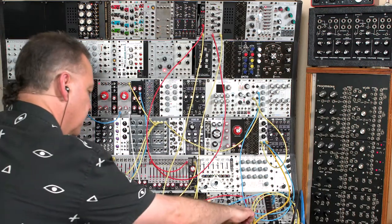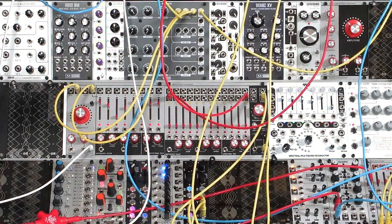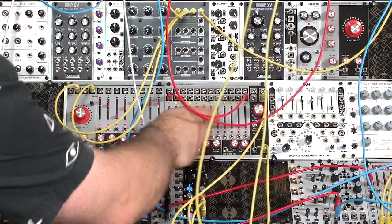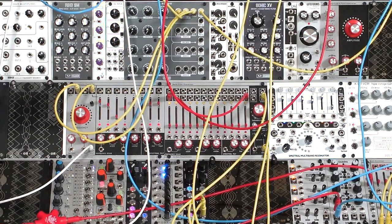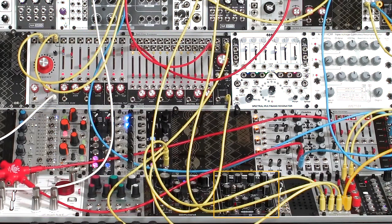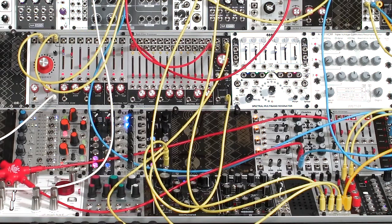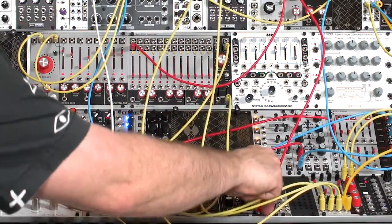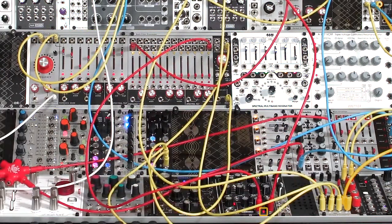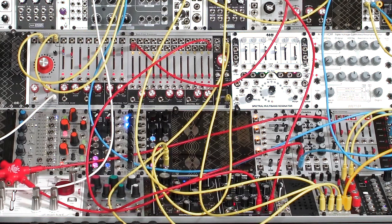It sounds like we have a little trouble with multiple triggers. That's happening because currently I have no smoothing of the signal coming out of the envelope follower. The Bark filter does have a follower decay knob, which allows me to slow the decay of voltages coming out of it, but it doesn't really cure attacks that are too noisy and too fast. To do that, I'm going to use some sort of trigger processor — I quite often use a gate delay, such as the one built into the Roland 572, not to delay the gate, but to add a fixed hold-off time to prevent triggering too fast. Taking the patch cord running to the Pico drum's trigger input through the gate delay, you can already hear how the Roland 572's gate time parameter is holding off re-triggers to get rid of spurious ones. That's an improvement.